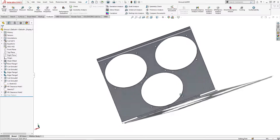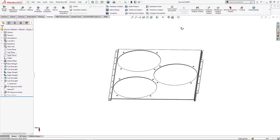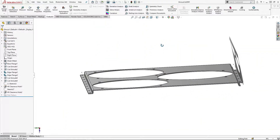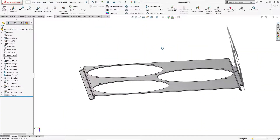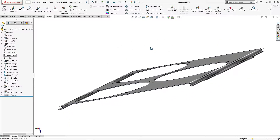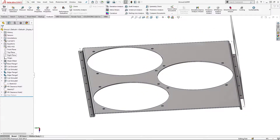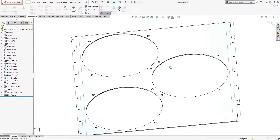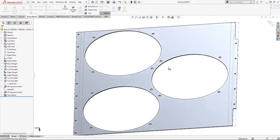I've designed this sheet metal part in SOLIDWORKS. The fans are going to sit just like this. We might hook them up to some switches so that we can enable one, two, or three fans depending on how cool we need to keep the radiator. I've also made a basic drawing so I know exactly what we're going to be doing today. Here is a look at the flat pattern and everything we're going to be marking on that aluminum.